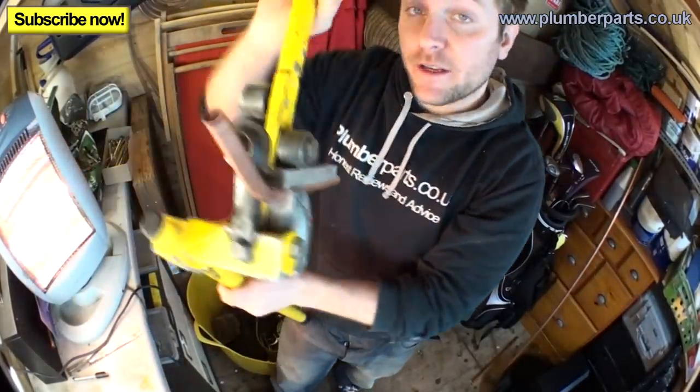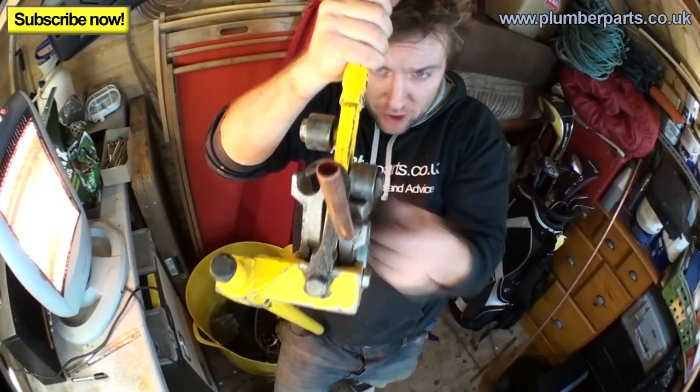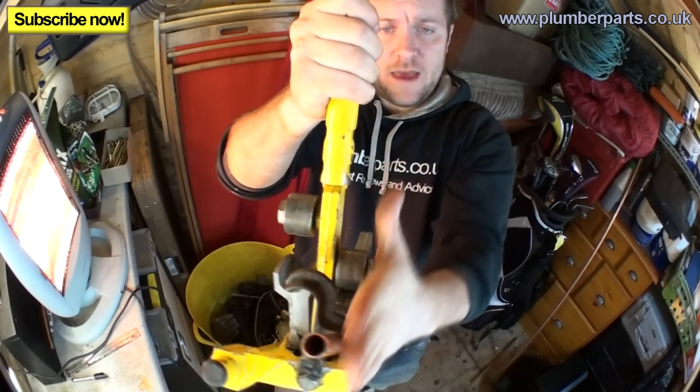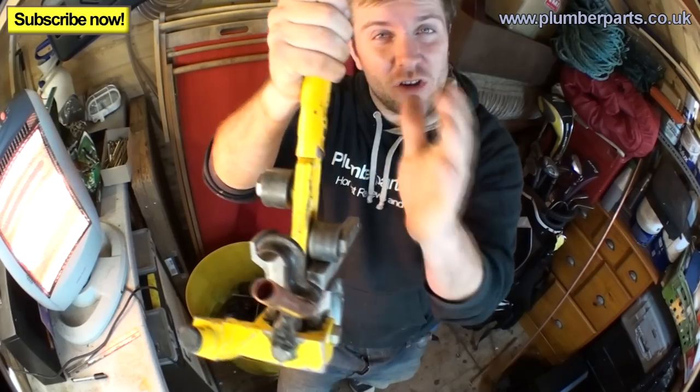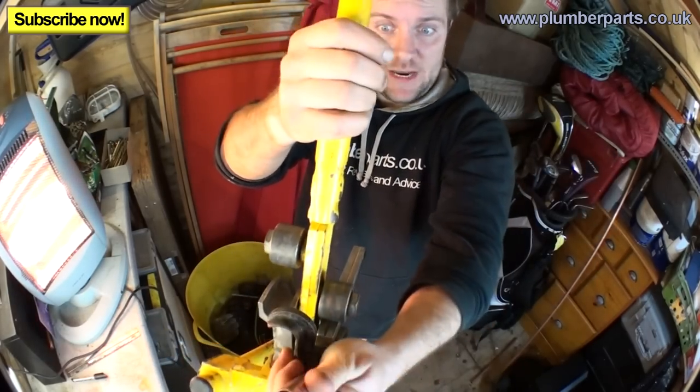Now most blokes on site, this is what you're gonna see them doing for this bit. They'll rest the normal arm, the arm that you don't move, on their hip, and they'll have a look down the pipe, and they'll just lift this off, and they'll just make sure that their pipe is in a parallel line with the side of the former. So when you do the bend, it doesn't wobble when it's on the table. So we always do a little wobble table test sometimes.